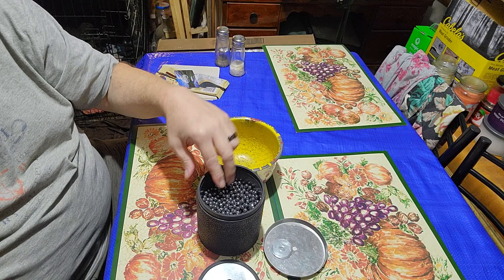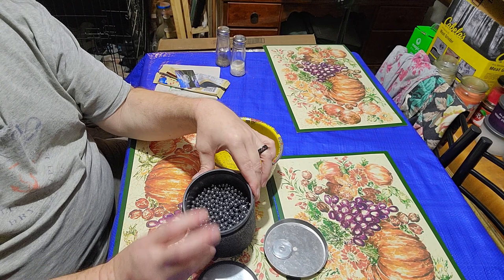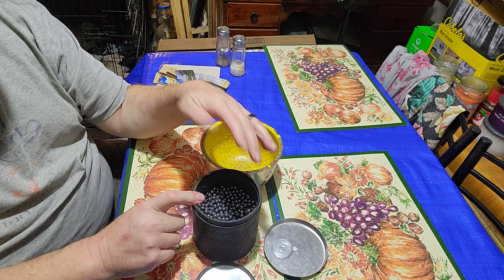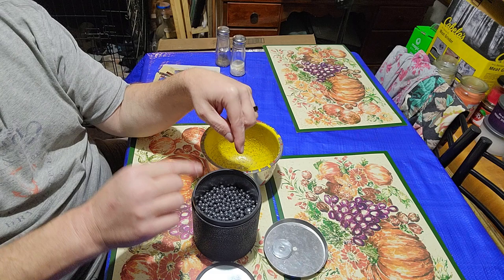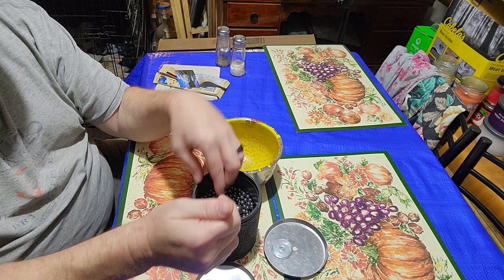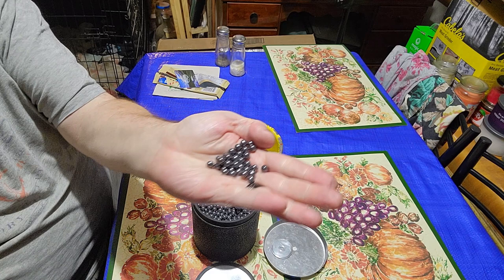We've got probably a little better than three quarters right here — that is best. A half, you're almost rolling the dice. I have found three quarters or just above three quarters is going to give you these kind of results 100% of the time, if the tub is dry and the pellets are dry. This will be your result every time. I did throw a half a dozen of these big 70 cal ball in there with the number ones to really hammer on them good.